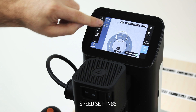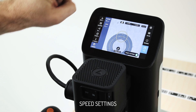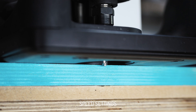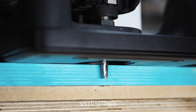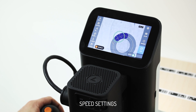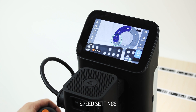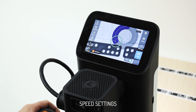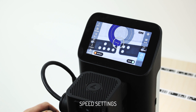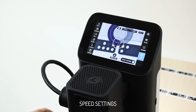First we'll look at auto mode. The default we're used to is 15, and we can turn that down to a very slow speed — here's five. These are just the presets; you can enter whatever you like. Plunging at the regular speed, Origin behaves as normal except when we hit auto, and we'll see it move very slowly. This would be for a small diameter cutter that's very delicate, or hard material, or both — so you can start to tune that to get better quality outcomes and protect your cutters more.